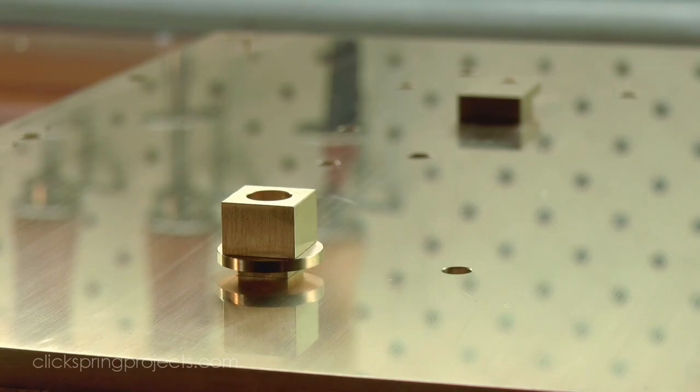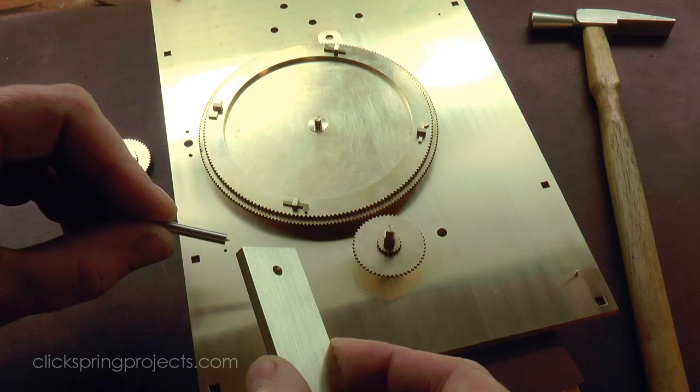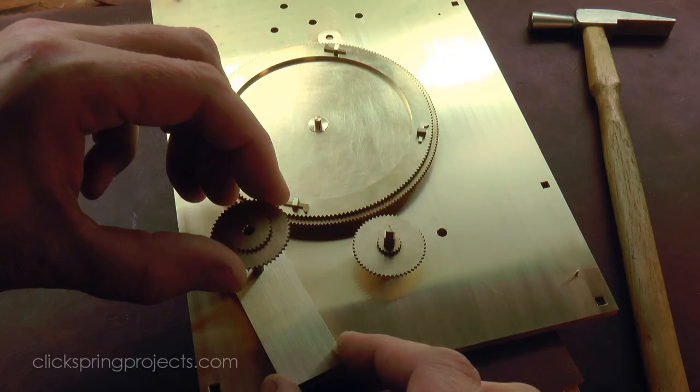So it's worth pointing out that the maker's choice of putting the F assembly on a post rather than an arbor permits the use of a very simple and practical depthing tool. This means that the depthing can be left until after the square bearing has been fitted, and so any position error can be accommodated without issue.